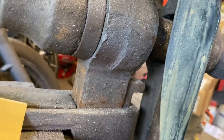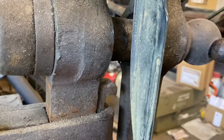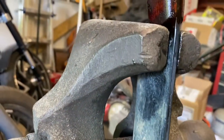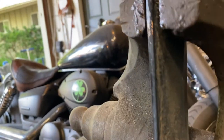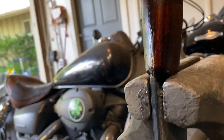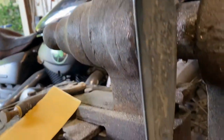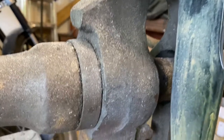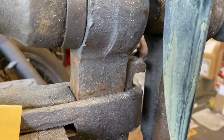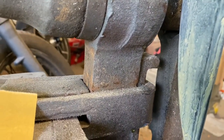And then you just buff it off with, I use 4-aught steel wool. And then there'll be a nice, thick, heavy black finish on that blade underneath all that crusty, disgusting looking rust. And that's what we're wanting. So it'll be really, really durable. And then once we get that done, we'll do the final sharpening on the blade.